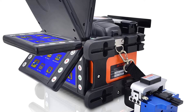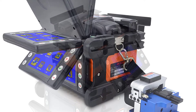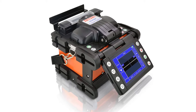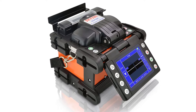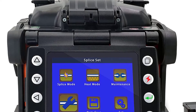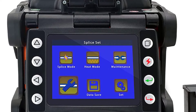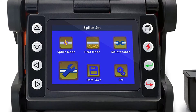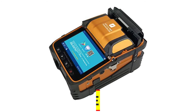This splicer is user-friendly, with a 3.5-inch wide LCD screen for easy and intuitive operation and improved visibility in low-light conditions. Three LED lights illuminate the entire splicing chamber. The SS428F is also designed for field use — a lower profile and lighter weight enhance portability, while its canopy design and ruggedized body provide resistance to shock, water, and dust exposure.